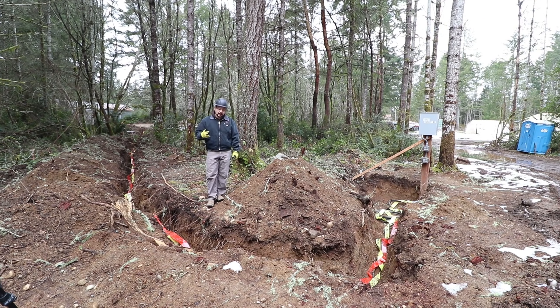You can see it down here — I have two different colors, red and yellow. I had yellow on hand and threw it in the trench, but then I went and bought the actual 'caution electrical line below' tape, which is the red stuff. Threw that in the trench, the inspector came out, and we were all good to go — got our sticker. Called the electrical company; they're scheduled to come out Monday. It's Saturday now. Before they'll do the connect, I have to backfill. I'll pull the ribbon out, backfill about halfway, put the ribbon back on top, and put the dirt on top of the ribbon.